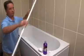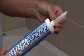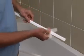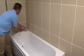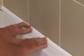Remove the profile strips from the bath and prepare the tube of silicone sealant, using the wide nozzle first. Use the alcohol wipes in the kit to clean all surfaces of both profile strips. Apply a generous bead of silicone along the length of the bath. Gently push the longer profile strip into the sealant. Use the Fugi silicone applicator to remove any excess sealant.